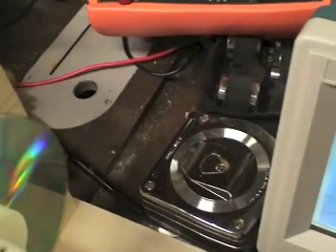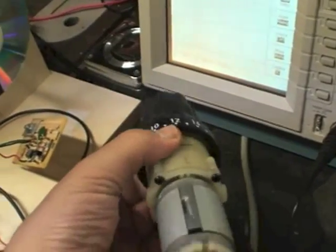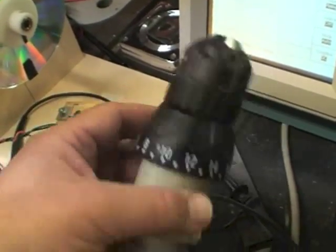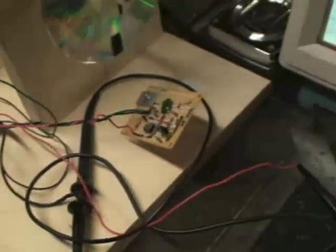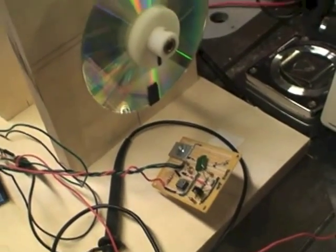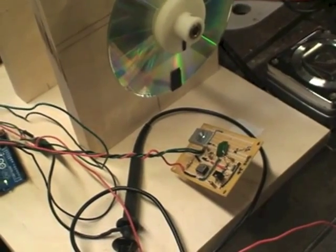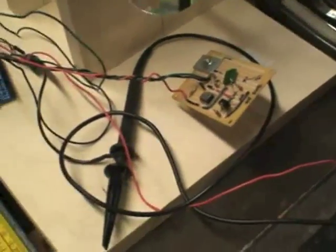Ultimately, this motor from a DC drill will end up being what drives the motor shaft, and that will be tied into the Arduino with a pulse-width modulator and a whopping big transistor to drive the motor, and an old ATX power supply to provide the 12 volts to the motor. I'll show you the setup in a second.